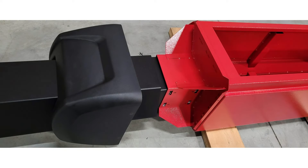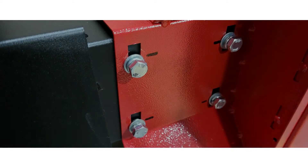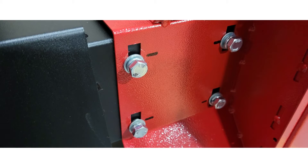Remove the eight bolts from the top portion of the tower and insert it into the bottom portion until the bolt slots are aligned with the threaded inserts in the bottom portion of the tower. Slide the shroud up onto the top portion of the tower. Ensure that the upper portion of the tower is supported so that it cannot fall to the floor. Then insert the eight bolts that were removed in the previous step and tighten them by hand until snug. You will tighten them further in a later step.